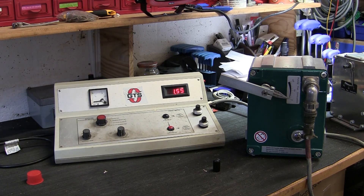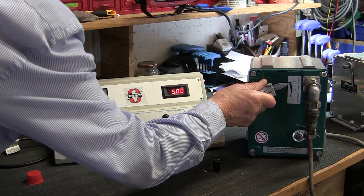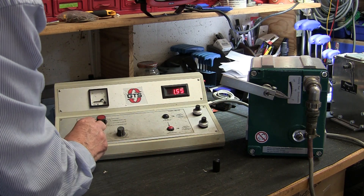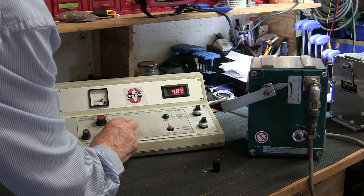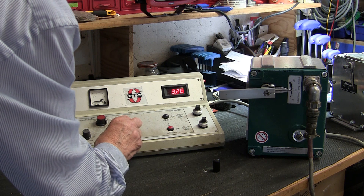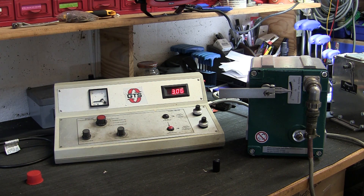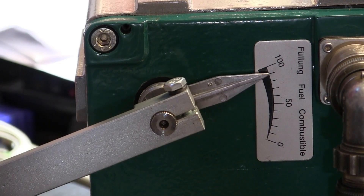On to the STG 30 now. Again, test the feedback: 5 volts for 100%, 1.5 volts for zero. Put the drive on and we can position it. This one's got a fault - that's it positioning.